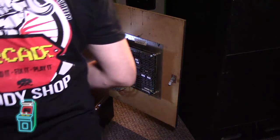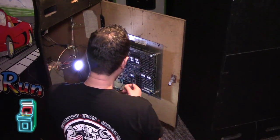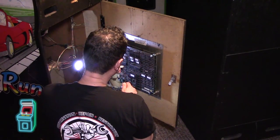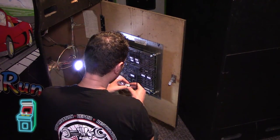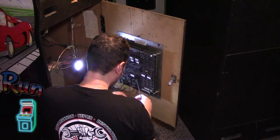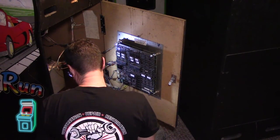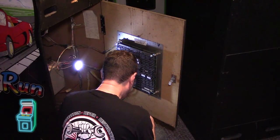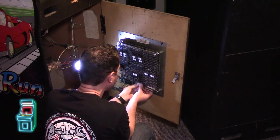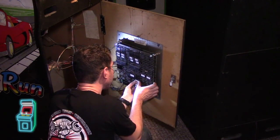These say x2 — these are 512 chips that are supposed to be 256 chips, but I burned double ROMs. The first one should be OPR-10188. Let me orient them correctly. Road, samples, FM synthesis — I'm going to fire it up. I'll leave this on here, grab my remote, turn it on and see if anything is different.